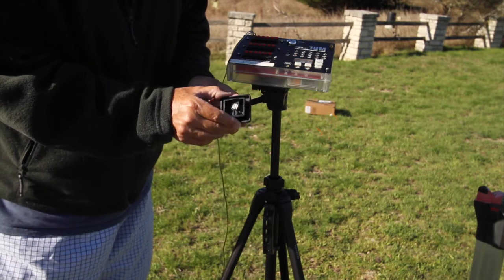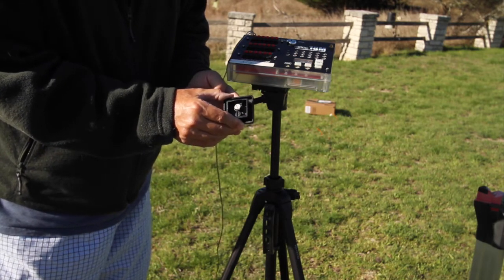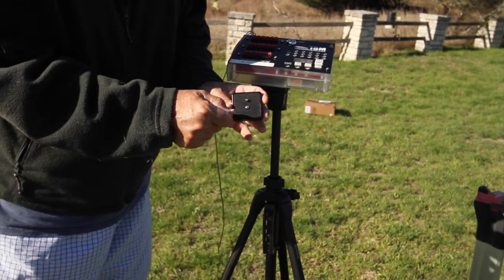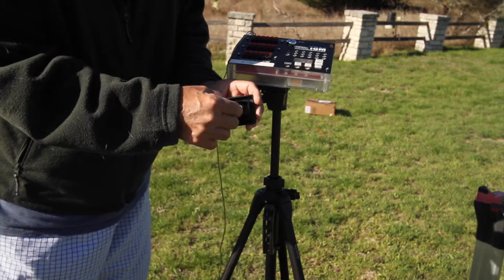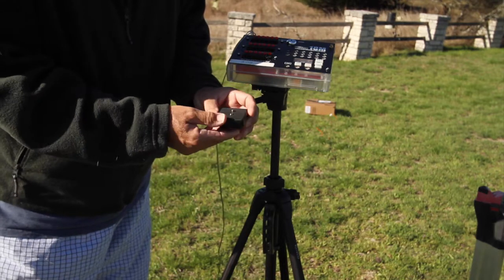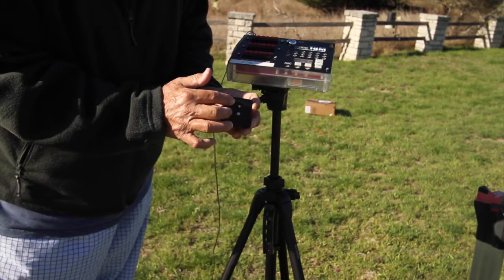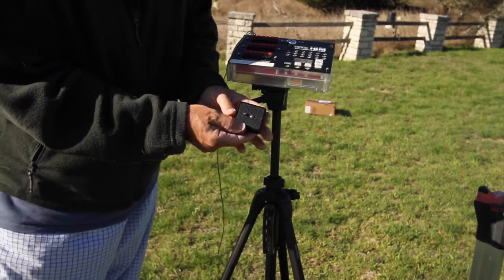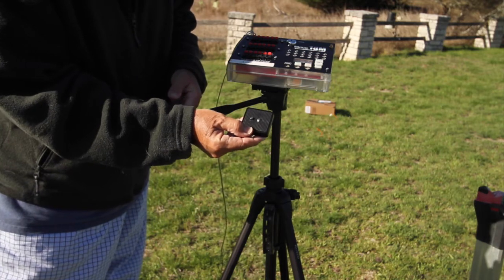Some of these plates, this screw is captive, and if it's captive, I just flipped it over and banged it out with a drift and a hammer. If you can unscrew it, then just unscrew it. But the bottom line is you want to get the top of this plate flat without any protrusions, so it'll glue up properly to the bottom of your Cobra module.